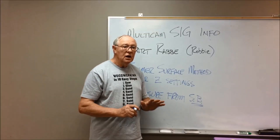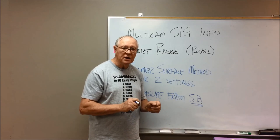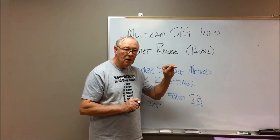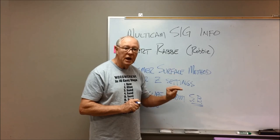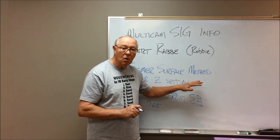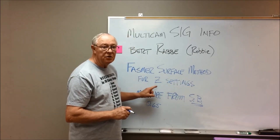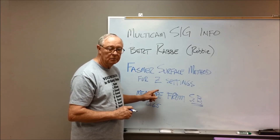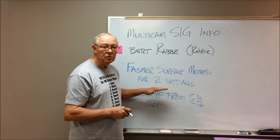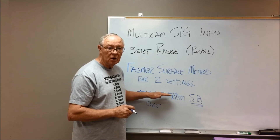And now when I cut, it's doing everything off of that spoil board. All the work we've done on the spoil board has been to try to get that as level as possible. So by doing this approach — having a depth that is at least as high as the highest point on my material and cutting to the spoil board on a uniform basis — I don't have to worry about whether I measured the board surface height at the best place. I'm working off of the spoil board. Use this method any time you are cutting all the way through, and you will not end up having to repair the spoil board or be left with a lot of onion skin. Thank you.